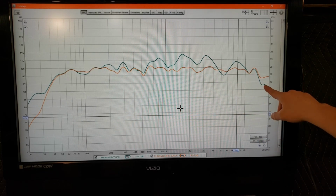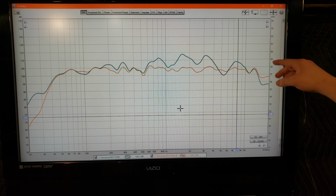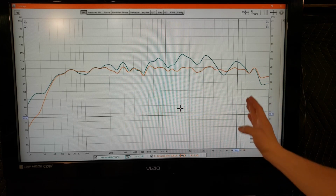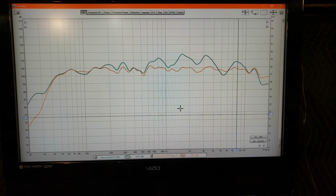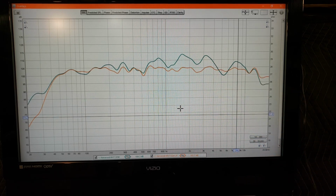Like this with the tweeter, even doing a +5 dB, it only brought it up a little bit. But then again, you're not going to really hear much of it. What I wanted to flatten out is really up to about 10K, and I was able to do that. And when I listened to them with this EQ, they are way less fatiguing. With the default of this, oh man, you can't turn them up very loud. You got to be careful what you listen to.